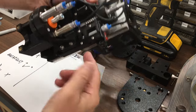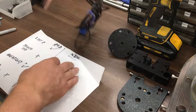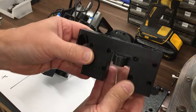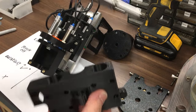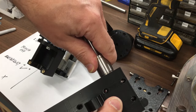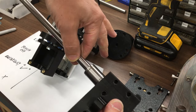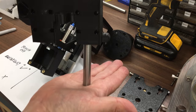So what I decided to do is keep the ball screws, keep the linear rails, but everything else downstream of that would go. And basically what I'd end up doing is replacing this bit with this assembly here. Yeah, that way around. Well, it's hard to see on camera, isn't it? So we've got some big holes there, and the idea of that is I had some of these lying around off a different project. They would be a nice fit into there, one top, one at bottom, and I'd have two of these, and so this would move up and down, and this, you know, barely any friction, really smooth running. It'd be slightly spring loaded, but the touch off for the lower piece would be done with that.